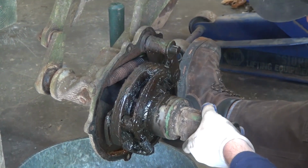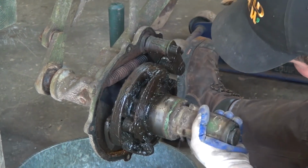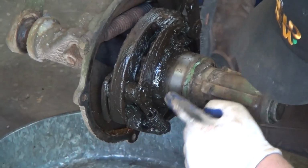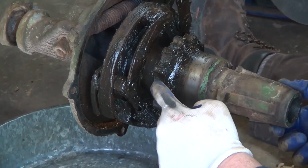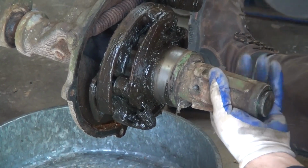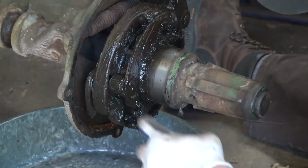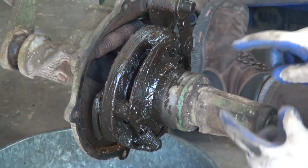And as you engage, you have a spring-loaded roller right here. There's the other spring inside of your clutch right here, and it holds this roller tight in the end of this cog or arm. And this roller engages these teeth, and it's got a slot such that if you back up, it just simply slips the clutch like an overriding clutch. But if you go forward, it pulls it down with the spring tension into the cog, and it makes this whole mechanism spin inside here.